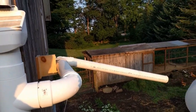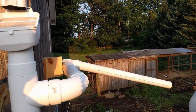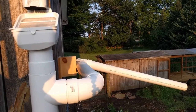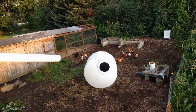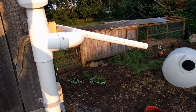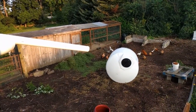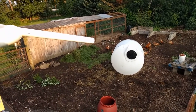This last part isn't rigged up yet — I'm going to have to cut that pipe, put an elbow on the end of it, and orient it right over my tank, which is right there. The next step is to build a post and beam frame that I'm going to put that tank on, so I need to start cutting that up, pour some footings, and get that tank up in the air.